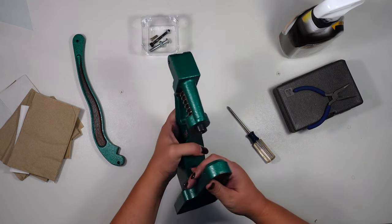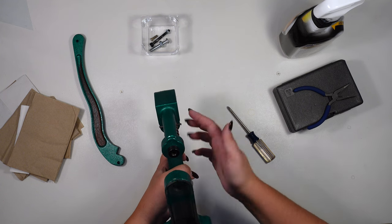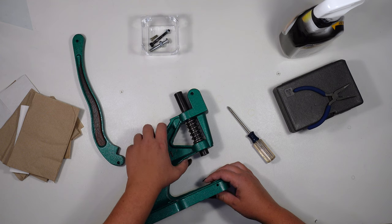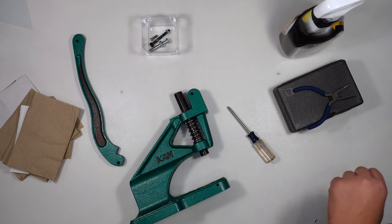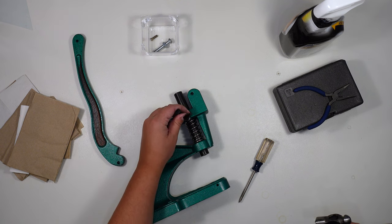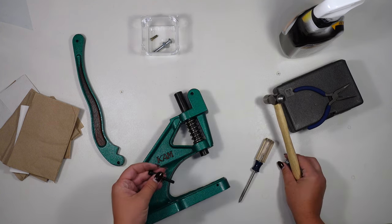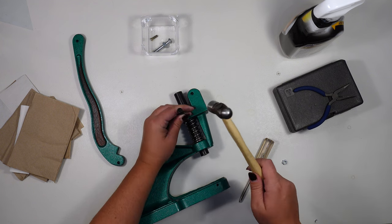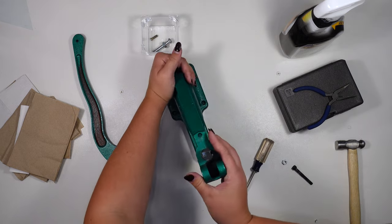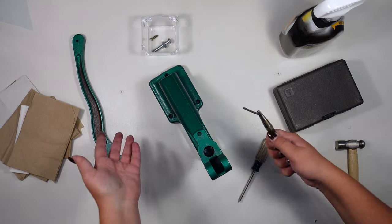The first thing I'm going to try is just to pull this guy out. My little peg here that they've used to hold this spring in has a bend on this side where it was inserted and cut off at the factory, so I'm going to want to get it out the other way. I'm going to try to lightly hammer this out. I might try using a little screw to get that out — we'll see how much tension it's under. I just have a very small jeweler's hammer here. Okay, that actually moved pretty well and it's almost out — there we go, got it out.